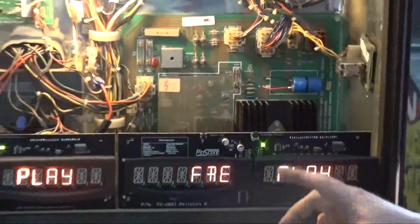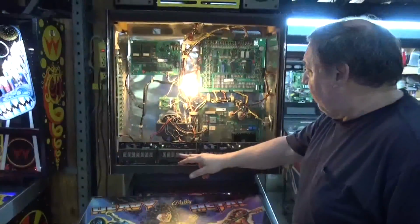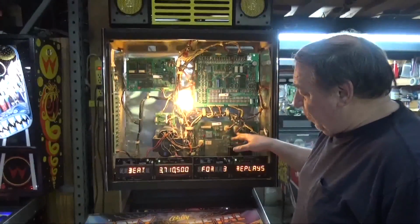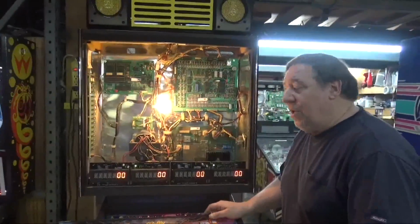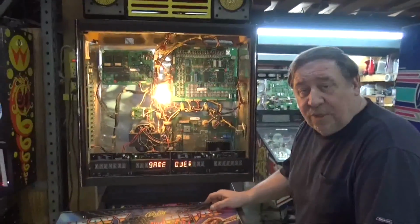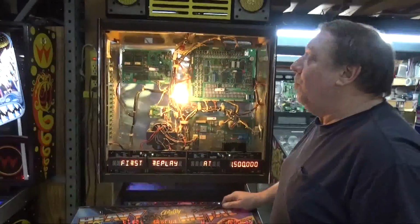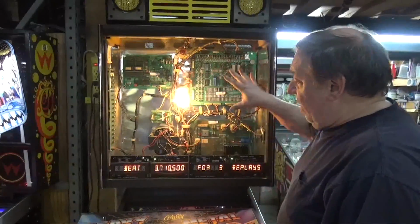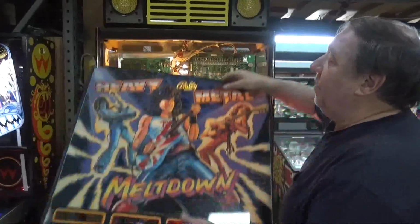Look, Pin Scores were in it when we got the machine, but they make the Pin Scores to replace the fussy high voltage of that board, and also the fussy displays. Those glass displays are special length. Some people thought they were the same size as the ones that Data East and Williams use. They're not. They're completely unique for this system, and when they go bad, that's the end of it. I don't think anybody has them in stock. Now everything is nicely reheated, and will run for years, we think, without any trouble.